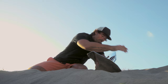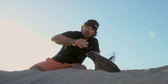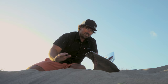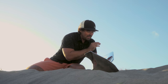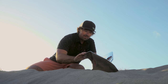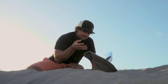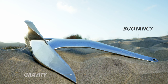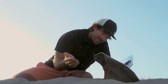There's clearly no roll bar on this anchor. We've heard things in the past where people say the roll bar can get caught in seaweed, or when it gets pulled into the sand it aerates the sand and can lose some hold. The logic on this anchor is that this massive fluke — and it is massive — is filled with lead, and the shank is hollow. So we have gravity and we have buoyancy, meaning this thing supposedly cannot fall the wrong way up. It's going to be fun testing that one, but we'll see if they're right.